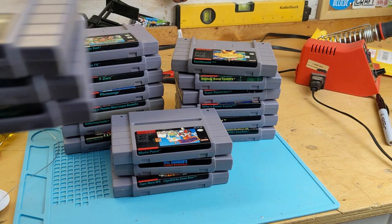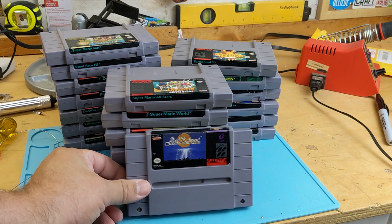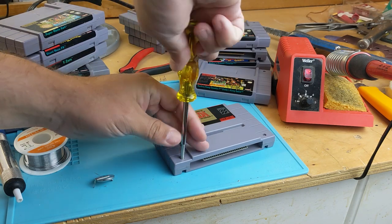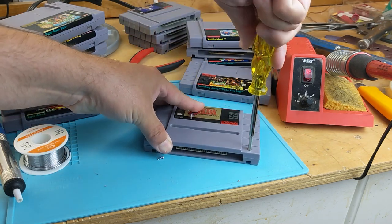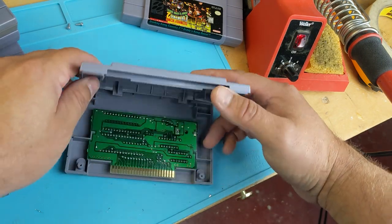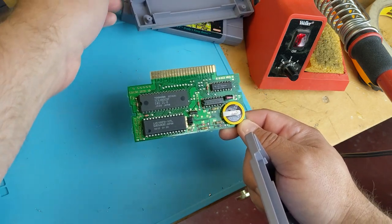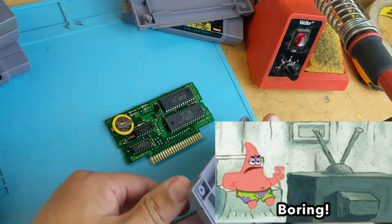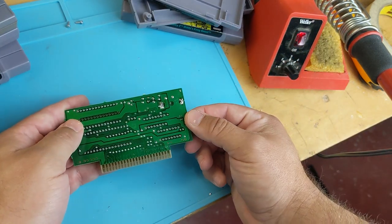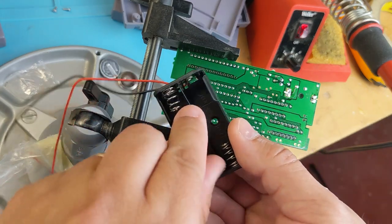You may want to save the data before the battery finally dies. Luckily there are two methods — one more polished, one quick and dirty — and both are easy. Both methods work by wiring an additional battery in parallel. When wired in parallel, voltage is not additive — current is — so voltage never goes above 3 volts. As long as the circuit can maintain that 3 volts, the data will remain in memory. Any additional current capacity from the second battery doesn't harm anything, as the circuit only draws as much current as it's designed to draw.